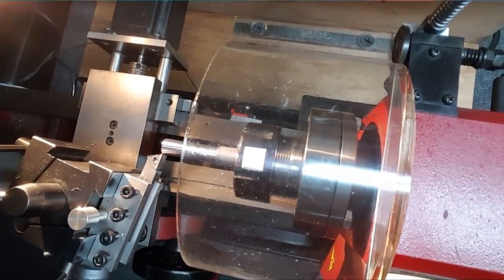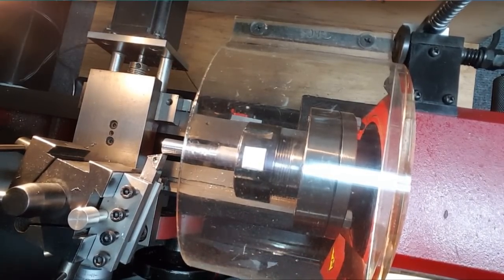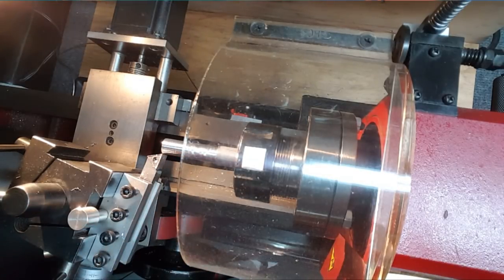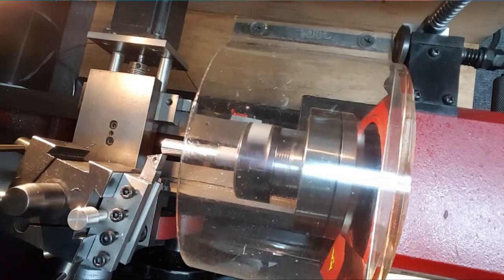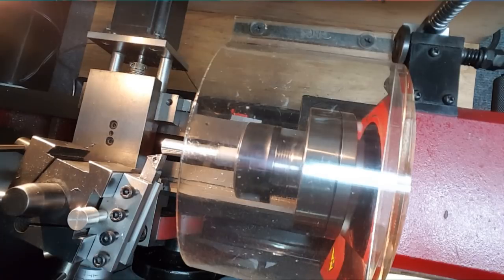Trying this, everything bounces. Trying this on that gooseneck arm to see how it's going to work out. So I just got to take this down to 1/4 inch to thread it, and then a section out here goes down to 10-32, and I need to go to external, direction that way. And turn it on. I've got to put some juice on it. Again, this is just my mix of oil and, what was it, kerosene. And it seems to work really nice. So take a 5/1000 cut there and say go, right?